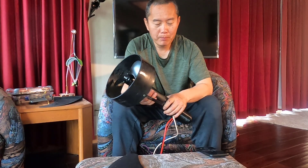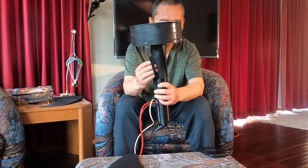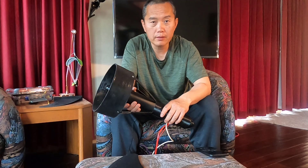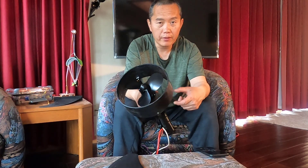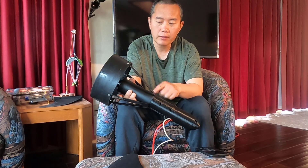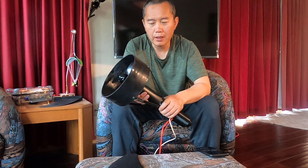This is my bigger underwater motor. This is a popular motor for the efoil — it's a 65161, which means it's 65mm in diameter and 161mm in length. That's a really popular motor for the efoil setup.